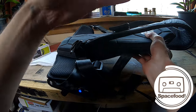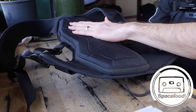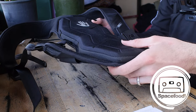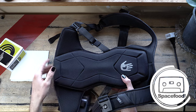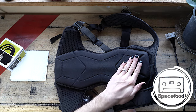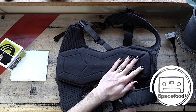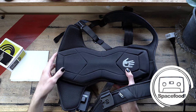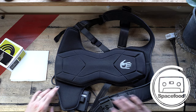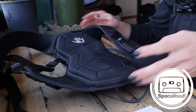So you hear how it's got kind of a farty sound. It's quite buzzy, and you won't be able to tell this, but there are actually two shakers in this. There's one on the bottom and one on the top, and the one on the bottom is not responding whatsoever. And then of course, this one has a horrible sound, which is not so good. So now that we've checked that out, I'm just going to turn this off, and we'll proceed with opening it up and getting these new shakers in there.